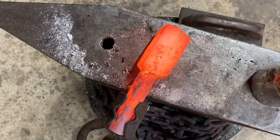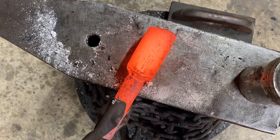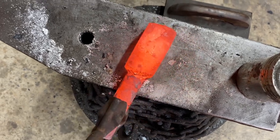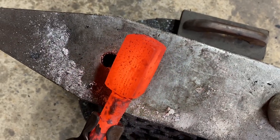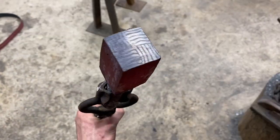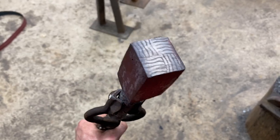We've done three welding passes now. It feels pretty okay — it seems like it's behaving as one piece of material. This is my first time pulling off a forge weld like this, so I'm not as confident as I normally am. I'm going to go ahead and grind off all that horrible mess on the end, take it to the hammer, and see if it holds together. That looks pretty stinking cool. The next step is just to draw it out to square stock and then do that again.